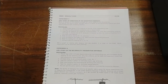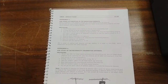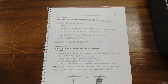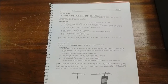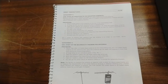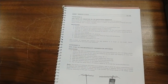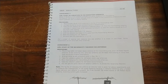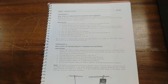In the next experiment, we will study the variation in radiation strength. The detector will show a higher strength when near the transmitting antenna and the signal shall reduce gradually with increasing distance. Mount a dipole lambda-by-2 antenna on the transmitting mast as in experiment one, and keep the RF detector at a distance of approximately one foot from the transmitting antenna. Adjust the level of the RF generator and detector so that the reading is at three-quarters as done in the first practical.